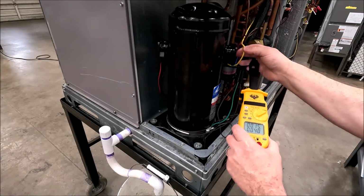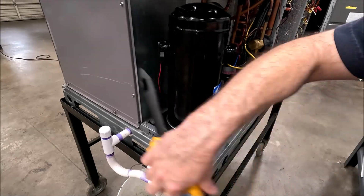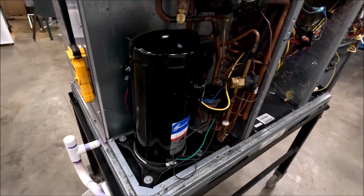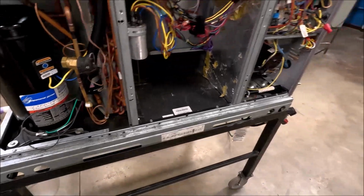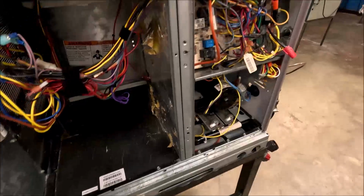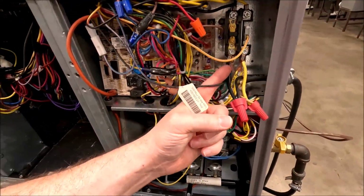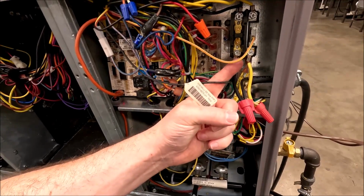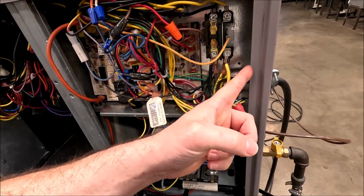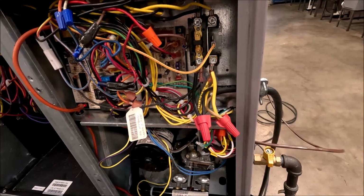So this heater, right, if we follow it, matter of fact, here we go. If we follow it, what you're gonna see, right? So we know it starts over here, bottom of the contactor. The switch is open, right? There we go. So at the bottom of the contactor where this crankcase heater wire is, that's always voltage there anytime the power's on, right? So I can't go through the switch, and I'm not going to the other side of power because that's gonna be a boom, right? Breaker's gonna trip, we got electrical short.